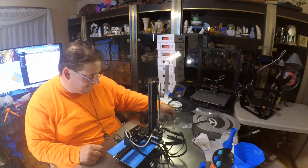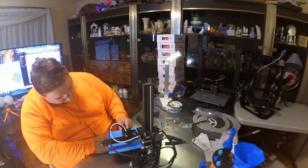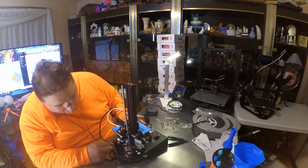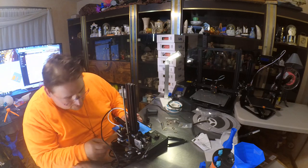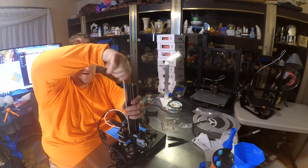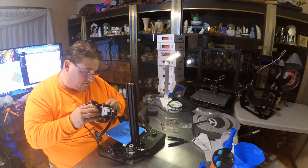It's like — what the hell did you do to this printer? I'm willing to pause you as I begin to tear this apart, but let me give you a rundown of what I see. First, this needs to be adjusted — it's probably, hopefully, just an adjustment, because that's pretty far out of whack. It looks like they built this right, though it might need to be pushed out more. This is in the right spot I think. Looks like it got tweaked a little bit. Hopefully it's electrically intact. They already ran the belt — the belt's attached. Grub screws are there. The Z-rod appears to be straight. This is all loose, this is all loose — I gotta take it all apart and put it back together again. I'll get the Z-rod out of the way and get this whole assembly taken off since I'm gonna need to go through the access holes to put this together again. It's completely missing bolts.